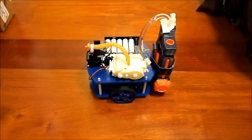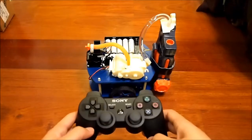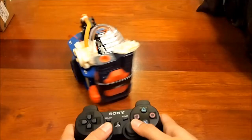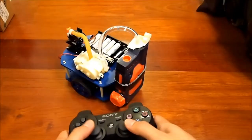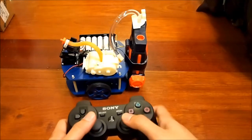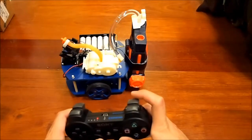This is a small mobile robot on which I've mounted the mechanism of a Super Soaker Thunderstorm water gun. I'm controlling it with a servo shock module with a PS3 controller. The left stick controls the motion of the robot using the differential drive mixer, and the right stick controls the turret, and the trigger will fire the water gun.